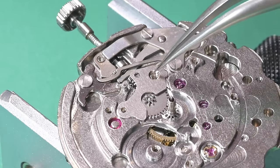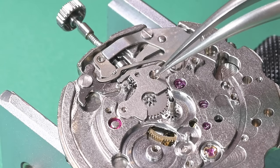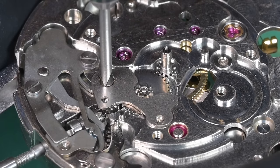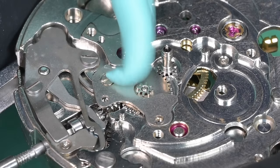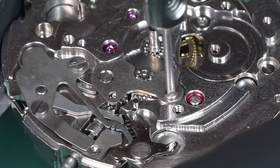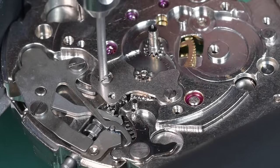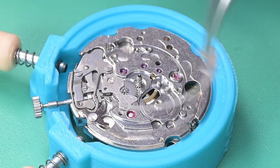On this minute wheel cover plate, the two screws that hold it down are different for each side: one is a countersunk screw and the other is a standard flat-undercut screw, so make sure the right one goes in the right spot.